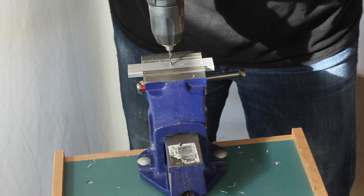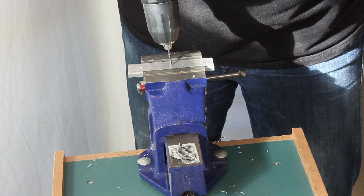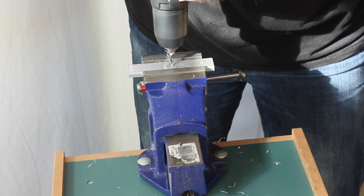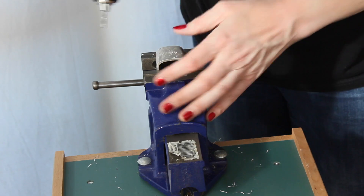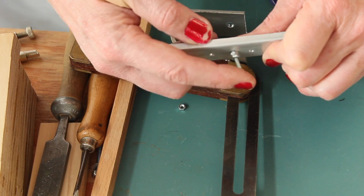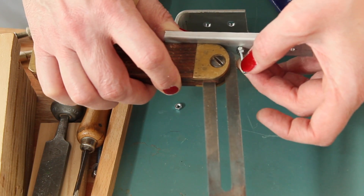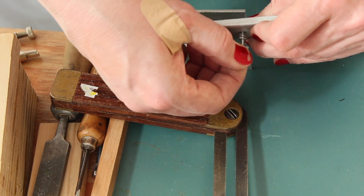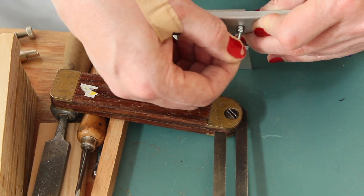A 3mm hole in the middle for the pivot, which I will explain more fully in a minute. Compared to the usually over-engineered solutions I can come up with, this is all I need for the pivot because that was the angle of the swing I need from the tripod legs and we've easily got that. We've got a little bit of play up and down — a millimetre — but as this is going to be hanging that's not going to be a problem. So we're there.